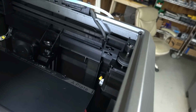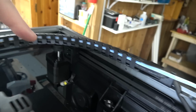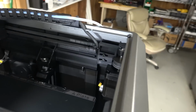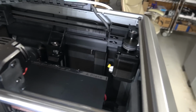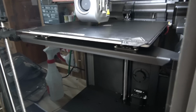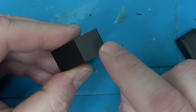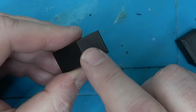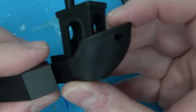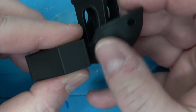So the other thing I just tried adjusting was these belt tightening screws back here. There's two of them there, two of them there. In this economy, I'm literally tightening my belt. Let's see if that makes a difference. I designed a small print that is in the basic shape of a Benchy. And it seems like tightening the belts did resolve the layer issue here. I'm not seeing it like before. You can see it in the boat there, but it's not there.